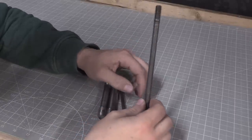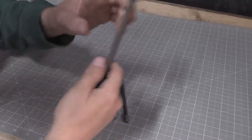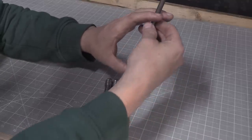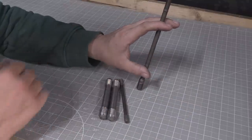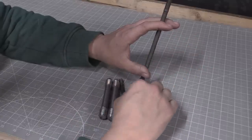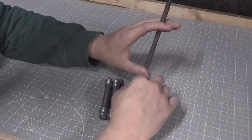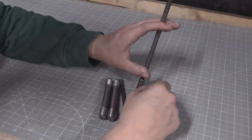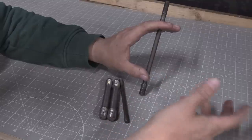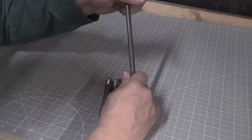what matters in tensile stress, so basically when you get this and pull, because that's what you're doing, is if you think about it, imagine in the middle here where my fingers are, there's a cylinder, you're going through the cylinder into the engine block and then to the head, just say, right? And what you're trying to do is squash this cylinder and the head down to attach them to, just say, the core of the engine. And for every force, there's an opposite force, right? So if you squash this down, that means this is being pulled, right?